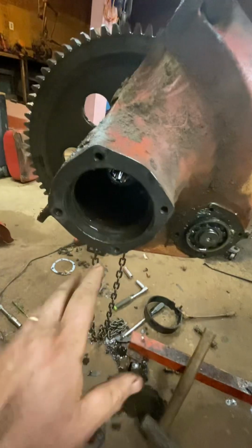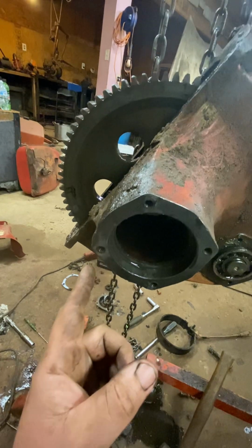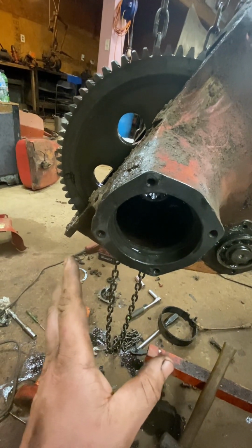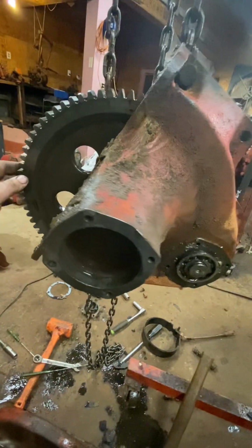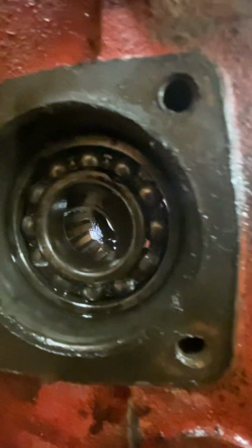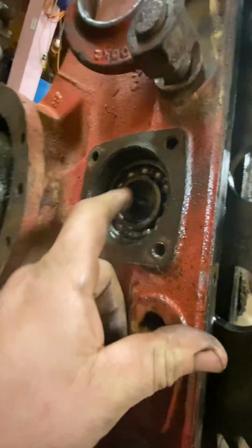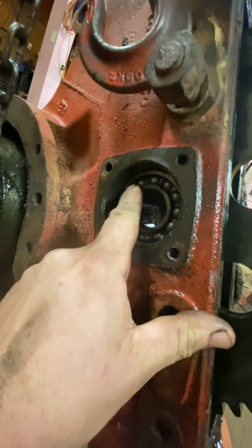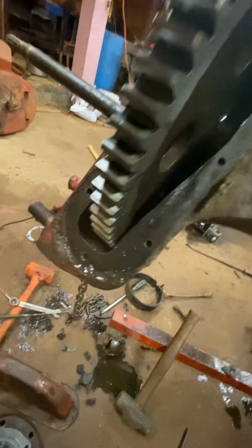If you pull these bolts out and you pull that nut off the inside while all this is still attached to the tractor, and you pull that bolt off the end and you don't reach in there, what'll happen is there's a washer behind here. That's the thin shim. You look at the parts breakdown, that's supposed to be in it. When I took my pan off, the inside washer, a thin washer that goes on the inside here, and then a thicker one that goes here, both of them washers were laying in the pan down here. For how long, I don't know.